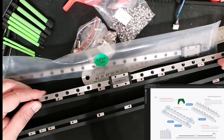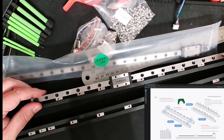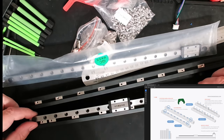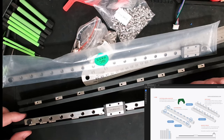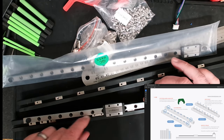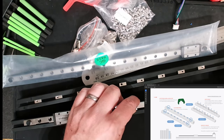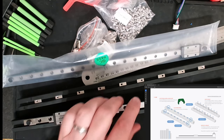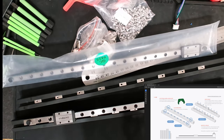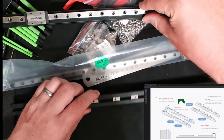I've laid the linear rail at 25 millimeters from the end on both sides. On my 350 build I'm using 10 T-nuts — five with the long way pointed one direction, five the other. You want to be careful because we'll need to put more T-nuts on here in a later step and you'll need that extra room at the end. I'm doing every other hole. I'm filming this on the 4th of July, so happy 4th of July to everyone in the U.S. Our family tradition is ice cream for dinner, so I'm looking forward to that.